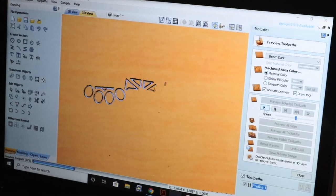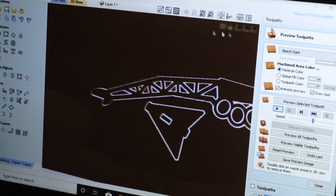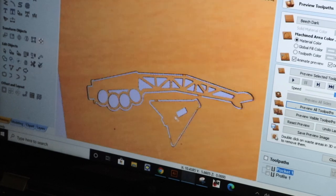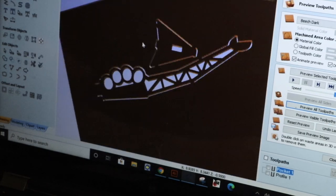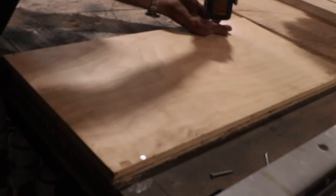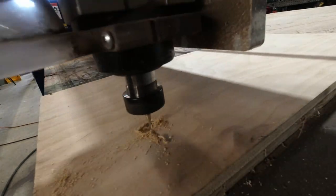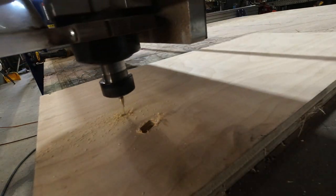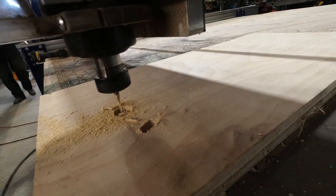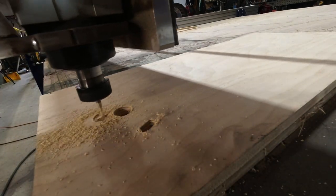This isn't the best solution, but I'm going with it. Now I'm in Vectric here running some simulations on the CNC I'm going to do. In the first pass I cut out the whole thing. In the second version, I cut away the interior parts of all the small pieces — those basically turn to sawdust so they don't risk getting caught up in the cut. If I was going to do production, this is the slower method of the two because it has to eliminate all that material. I'm cutting with an eighth-inch bit, so it's taking some time.